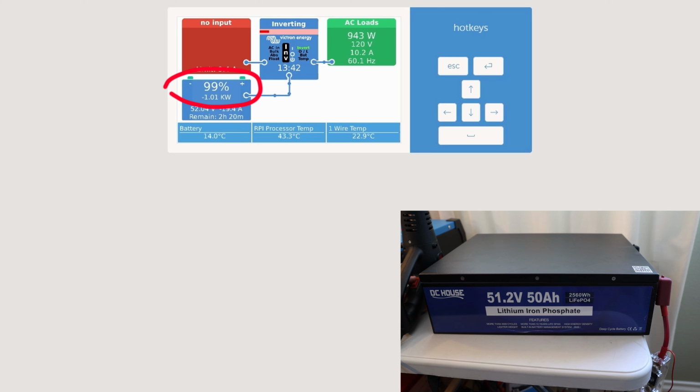So let's start the heat gun on low. That's what's happening. You can see 1.8 kilowatt. Good to see. Not enough, I'll crank it all the way up. Oh, interesting. The inverter just said overload, still says overload. It's handling it fine so far. Okay. We are at 2.65. So we are above the 2560, which we should pull. So let's see.